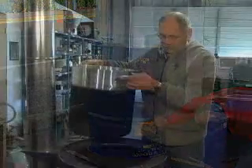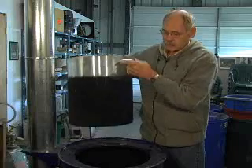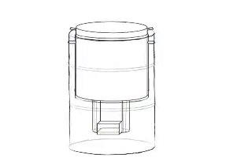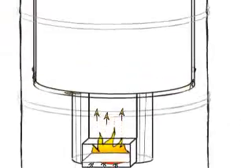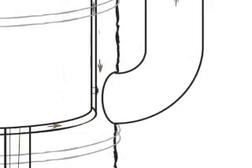These will accommodate a 50 liter to about a 100 liter pot — this is a 60 liter pot. The pot just fits down inside the stove like so. You light a fire in the bottom in the combustion chamber, which cleans up a lot of the hot gases being produced. The gases come up very close to the outside of the pot, and then they are forced to go back down and exit out the chimney of the stove, which is in this area.